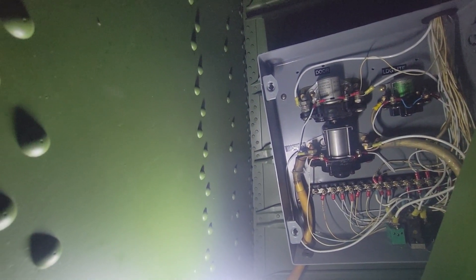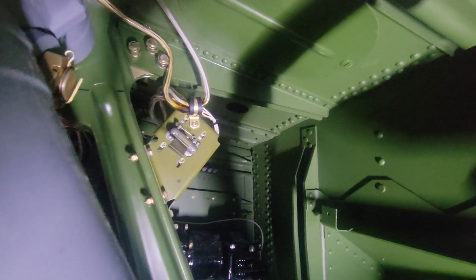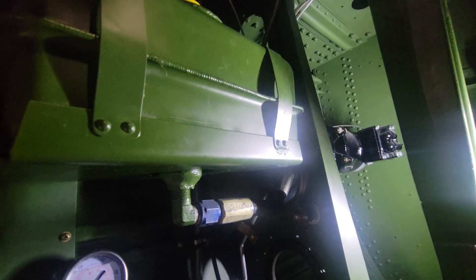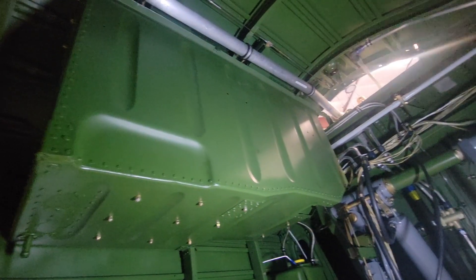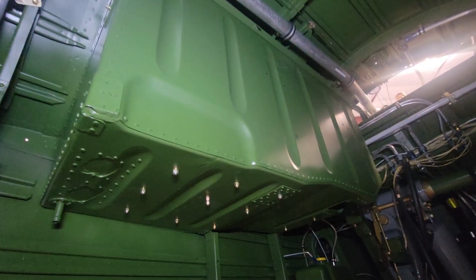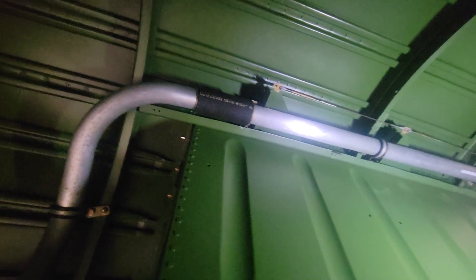Here's a junction box for most of the stuff going out on the wings and the engines. There's a switch right there that will basically cancel out the in-travel light for the landing gear. In this wing we have the hydraulic pump for the air stair. Up here we have that box that needed the lid — this would have been for the emergency life raft, and most A-26s that are still around do not have that. There's the cabling and the mechanism that operates that door.